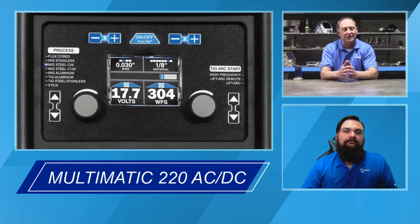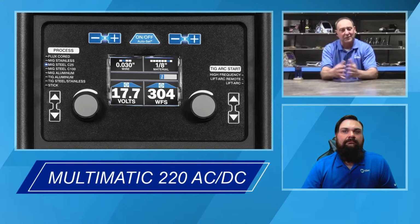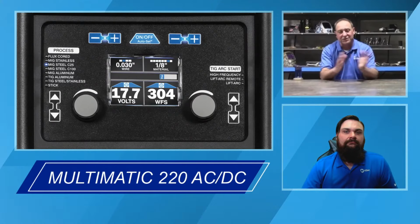Do you want to use a lift arc TIG like you do on the other Multimatics, or this machine actually gives you the capability to select high frequency, so you can start the arc similar to an industrial machine. Once you get this machine set up, you basically select the wire diameter and your material thickness, and the machine will set your voltage and wire feed speed for you, and you can fine tune it from there.